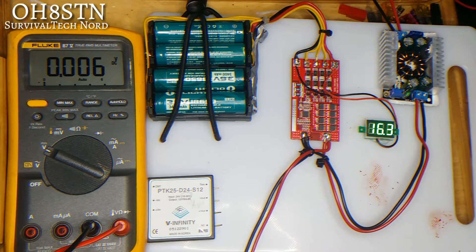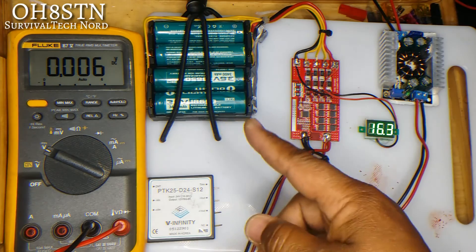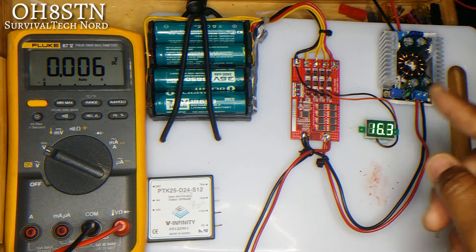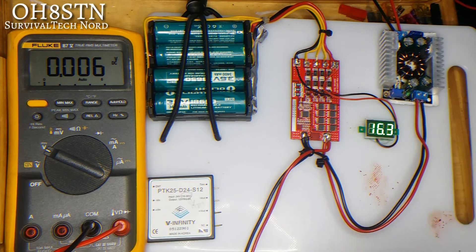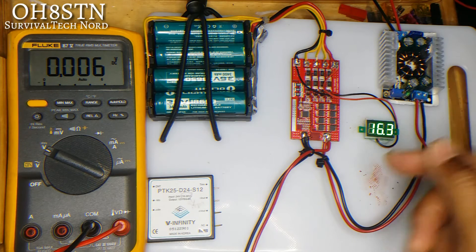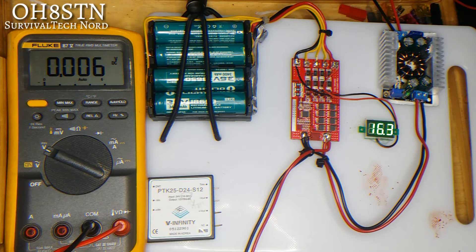Greek Preparedness and Cliff, two of my subscribers, were discussing whether it would be possible for the pack to self-start the BMS itself. Of course, we could do it by initializing the power supply or solar panel, whatever DC source we're using to charge the pack — but that's a little annoying. What we want to do is simply put a momentary switch between B+ and P+ — battery positive and power positive — to initialize the board. So let's do that now.